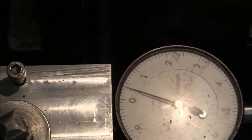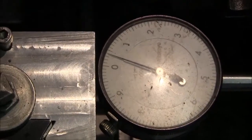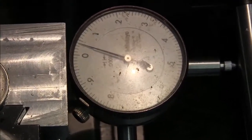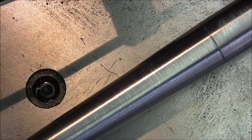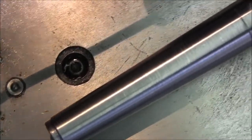If you're using the auto feeds and stuff, it's not really an issue. But when you're using the compound, your hand can influence it enough to affect the finish of the product. Now, that's the arbor I turned for the tailstock. I had to kind of polish the heck out of this thing to get those lines out of there. It fits in the taper okay, but just not so great.